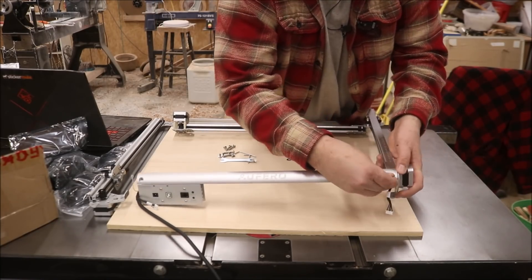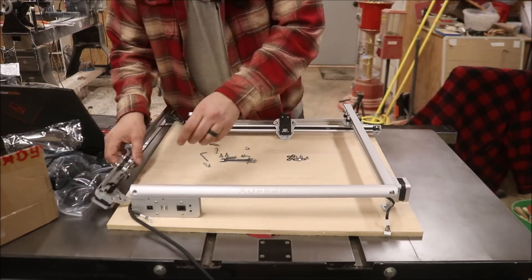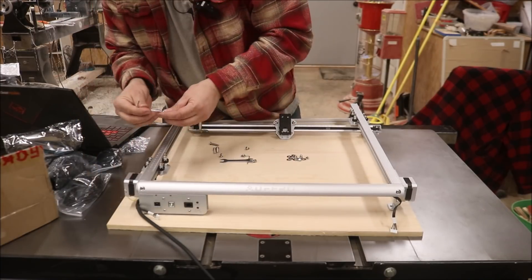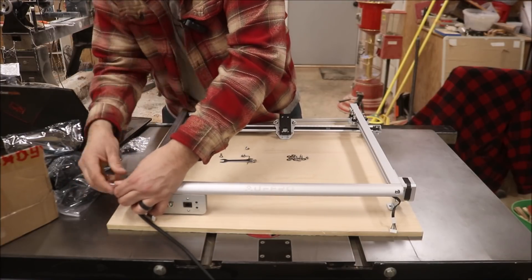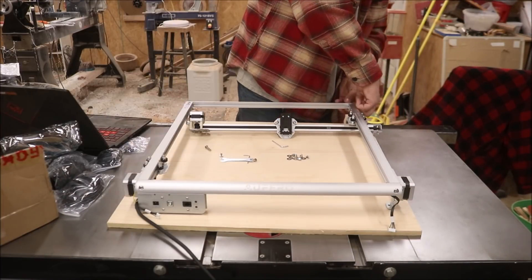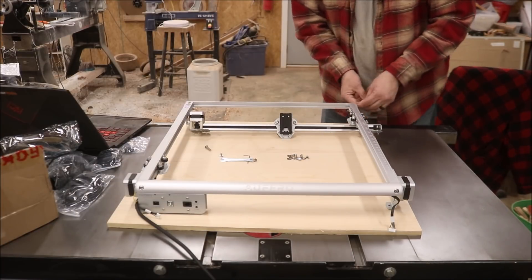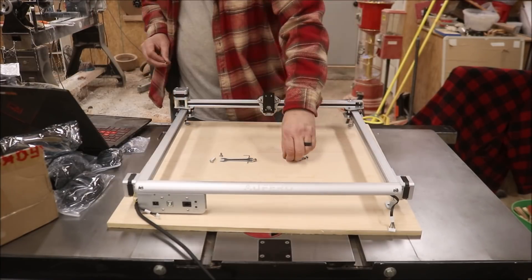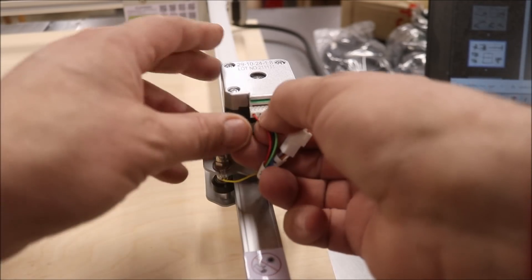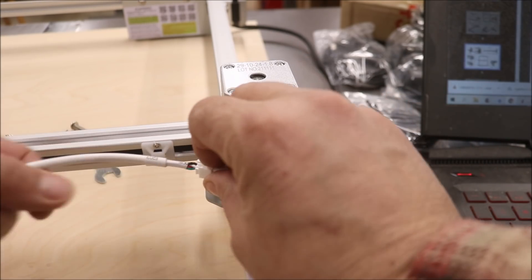To assemble the laser, all I needed was 12 screws and it was pretty much done. It took me about 30 to 40 minutes to get the whole thing up and running. I accidentally put the two motors in the front, so I had to take it apart and reassemble it — it would be better if you follow the directions. The machine is well put together, made of aluminum, with belts pre-assembled inside the side walls and gantry. Take your time, look at the manual, and route your wires correctly so you don't pinch them.